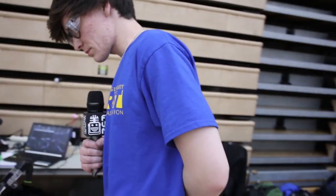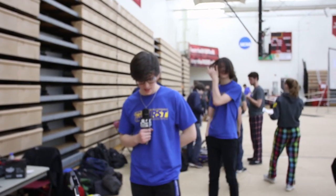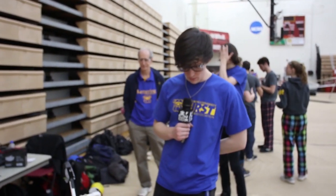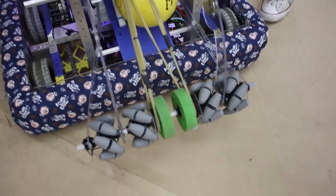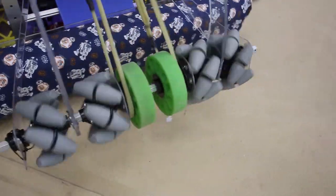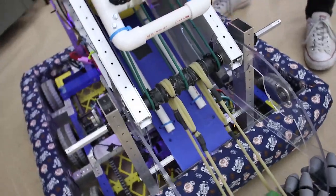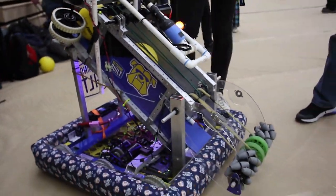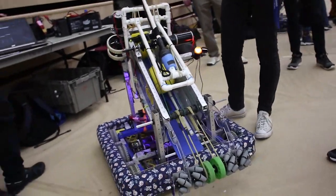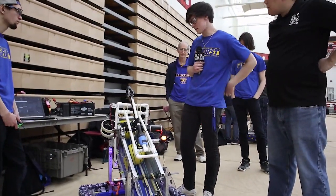As far as our intake goes, we experimented with a couple of things, including polychord belts, rollers, things like that. We ended up finding that the best option for us was using 4-inch mecanum wheels on the outsides of the intake and then compliant wheels on the inside. It's helped us to center the ball, so we have a wider range of ability to collect the power cells, and it transfers with surgical tubing off of our indexer motor. All of that is connected at the same time, and it transfers into the indexer and takes it from there.